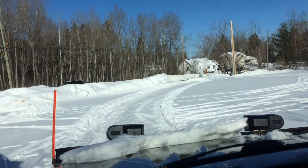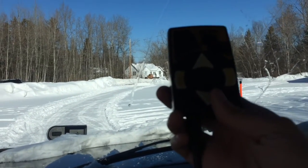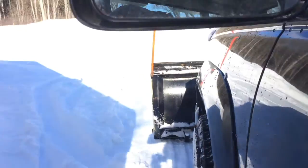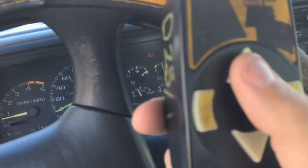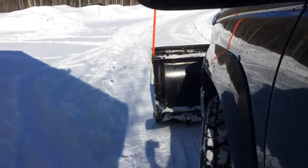Usually, nine times out of ten, I just straight blade it, kind of like this, because I have all the time in the world. So I'm just going to float the blade down until it just touches the ground. I could always push the button more, and notice that the blade actually curled in a little bit. I don't usually do that, because the cutting edge will actually dig right into the ice and whatever else, and the trip springs will just — there's no point. And I don't go very fast with it either — just moderate speed. The transmission never leaves first gear.